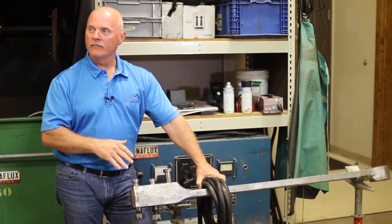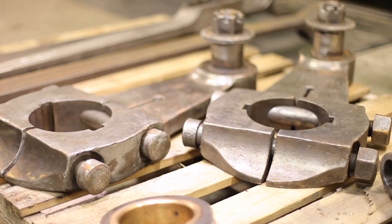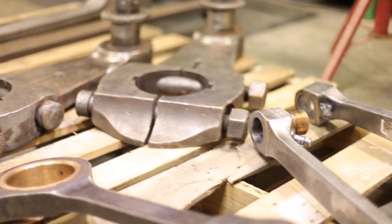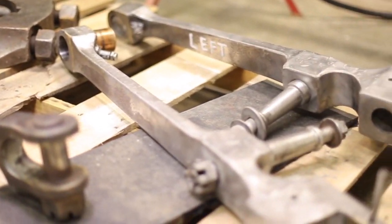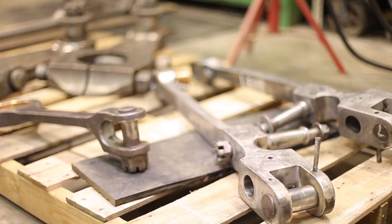This is basically just another way of doing larger parts that we actually can't get into the machine. We do very large parts such as the connecting rods that are on the wheels — those are tested for cracks using magnetic particle testing.